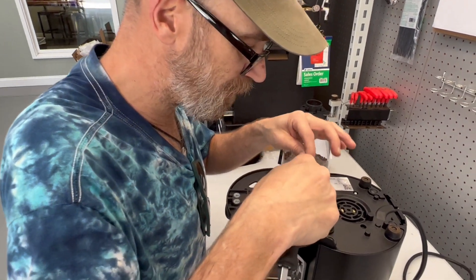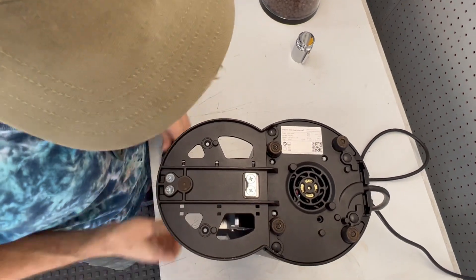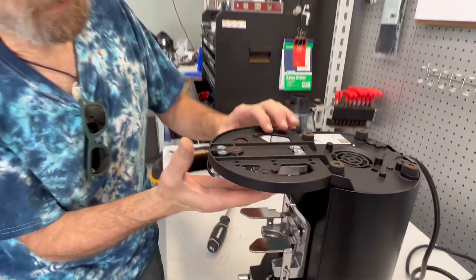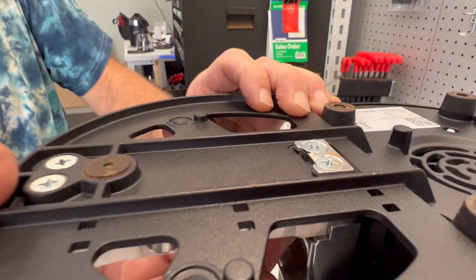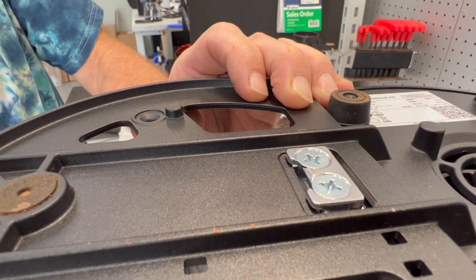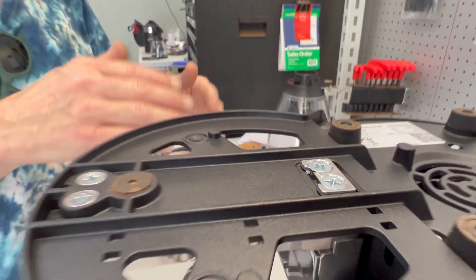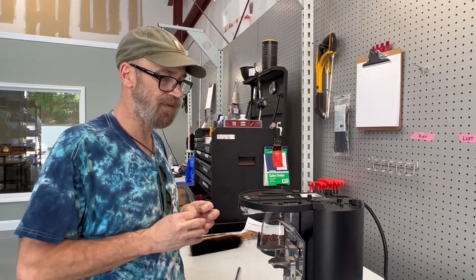We're in pretty much the middle of the window where we are not touching anything, and that should leave the load cell free to — if you push on it from above, you can see a slightly imperceptible movement. Same thing when you push down, it should be able to move up and down. Don't push too hard. That's just to verify that it is actually able to work.